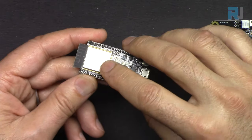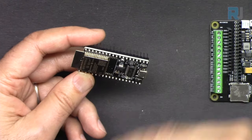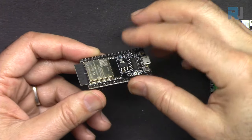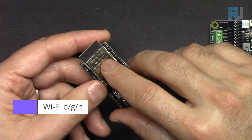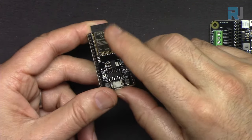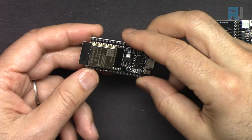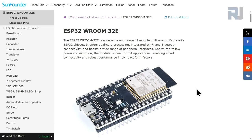This small chip is a microcontroller — like Arduino — that you can program. All the pins can read and write. It has PWM, digital-to-analog, and analog-to-digital converters built in. It has Wi-Fi 802.11 b/g/n and low-energy Bluetooth connectivity with security, with tons of features — all in a tiny board.